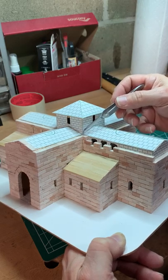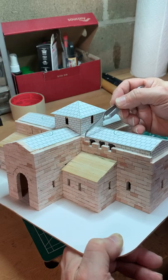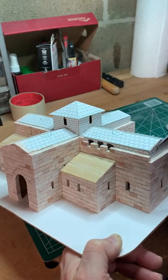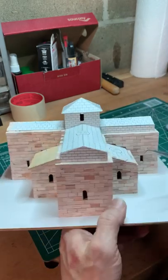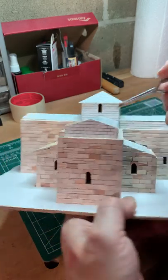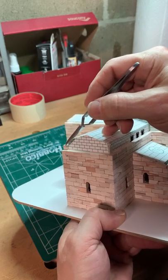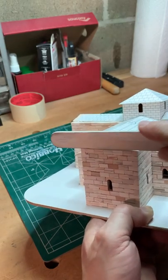If you've got a piece that, like this one, goes from the very edge and comes out, you want to start laying from that piece that hits this side and work outward from there. Don't work from this side into that way. Because when you hit situations like this, where this piece pops out a little bit, it's much easier to sand this down to the right level when you're done,